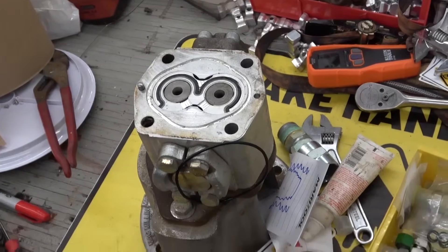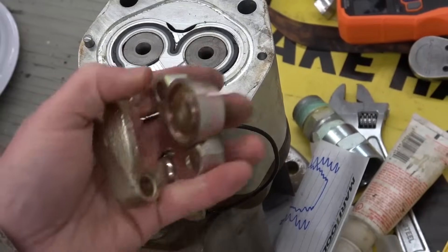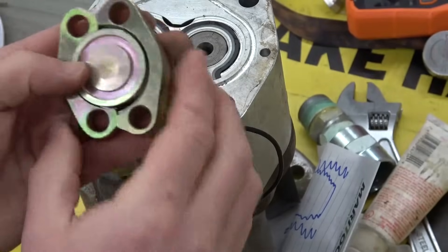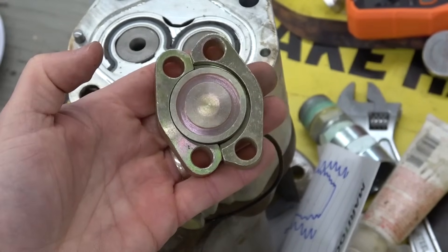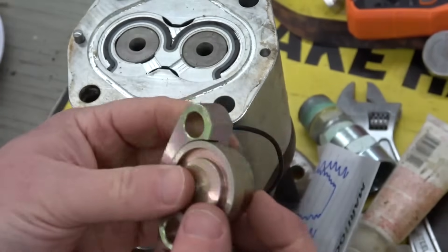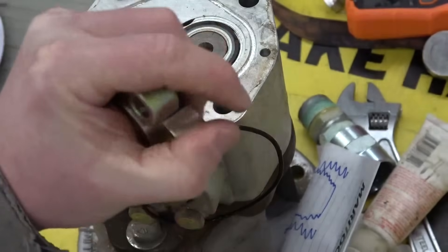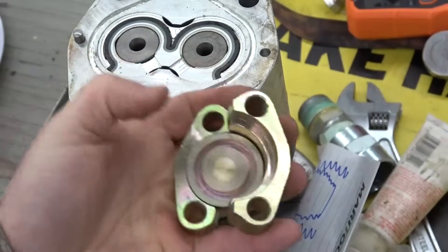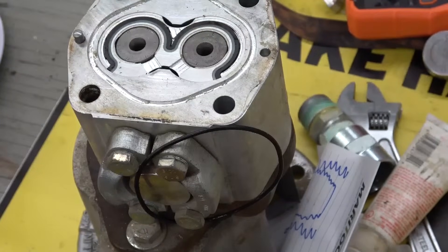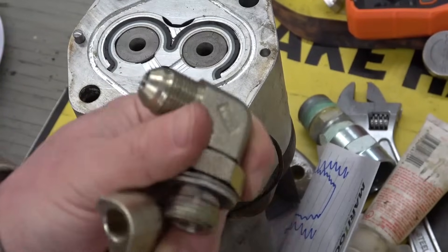Speaking of Babylonians, hearken now to our angry owl gear pump — he's not impressed. He's got a flange fitting there, plugged off. A flange fitting has an O-ring face and then it's got two bolts. You've got to watch it though because there is a CAT flange which is thicker and will not seal the SAE flange. The plug is beefier on the CAT — there's got to be thicker head bolts for the CAT. So there are flanges and they're different: two different styles. Just like Komatsu's got to have their own JIC fitting — they call it JIS.